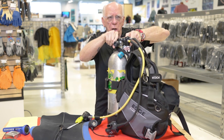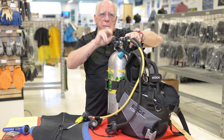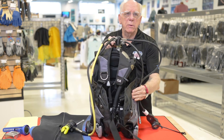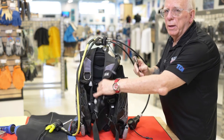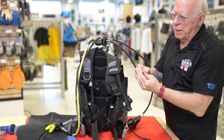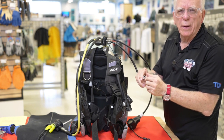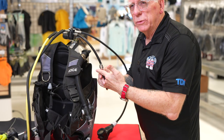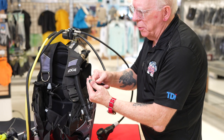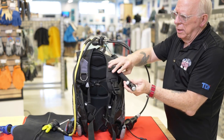I'm not going to put my hand on this yoke knob — I don't want to over-tighten it. I want to push and get it as tight as I can get it using my fingers only. Now I'm going to start over here on the left side and check this little slip ring — you see that moving up and down? These things sometimes become corroded when they're dived in salt water a lot. Again, who's paying for the rental of this equipment? You are. So make sure you're getting decent, well-maintained equipment. Make sure that slip ring moves up and down nice and smooth. Silver again goes to silver — now I'm attached.